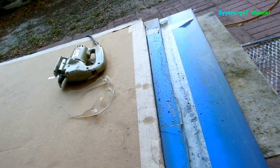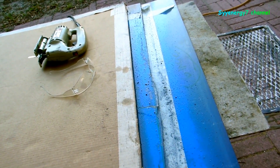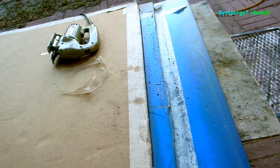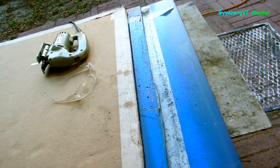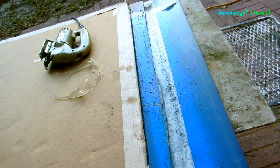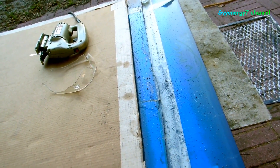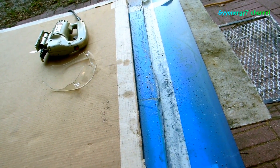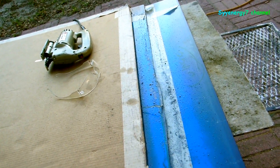I'm actually cutting up this 14-gauge steel. It's pretty thick stuff - about as thick as a cheaper gun safe. It's gonna go on the front door below the window, above the window, and on the sills. It's gonna get riveted and glued on there with liquid nails, and we're gonna have three big deadbolts on it - two on the bottom, one on the top.